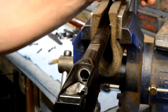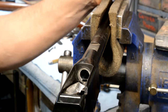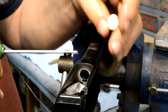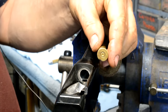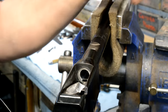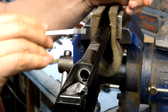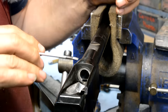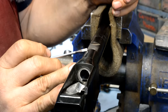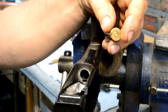You can get away with Acraglas on black powder single shot applications. There's a lot of square inches in here, and I don't care if you try, you can't run this gun hard enough to get this warm enough, and not only that, but the sleeve is trapped. So it's just like the Kammerlader. It's not going anywhere. If this was a centerfire smokeless round, that would have been silver soldered in, and the depth of this cut would have meant that where the chamber stopped, there would have been a hell of a stress riser here. I would not convert this barrel setup to a smokeless round.